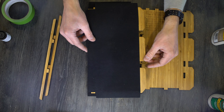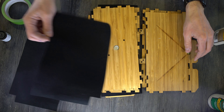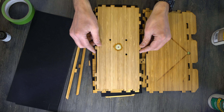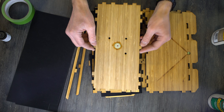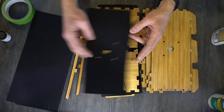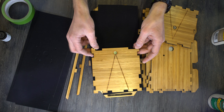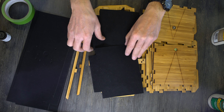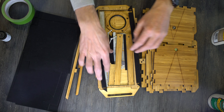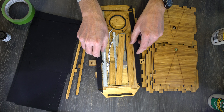This is a felt. The longer pieces of felt are for inside the sides of the camera. This is your other camera side with the bubble level felt. This is the pinhole. This is the front of your camera. This is the felt lining for the front of the camera. This is the bottom of the camera — you can tell because it has a tripod socket. This is the top, which has the bubble level. These are the two felt liners for the top and bottom. These thick pieces are wool gaskets, which are what the film holders rest up against. There is a specific way they go together, which we'll see during assembly.